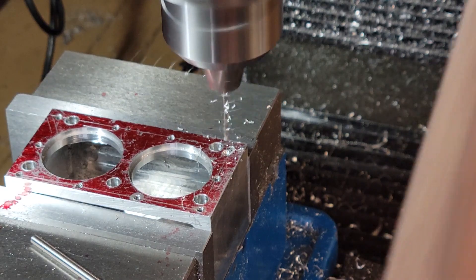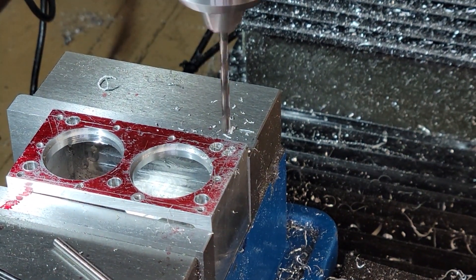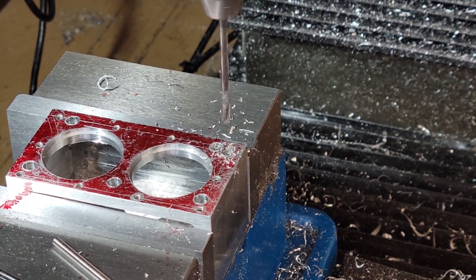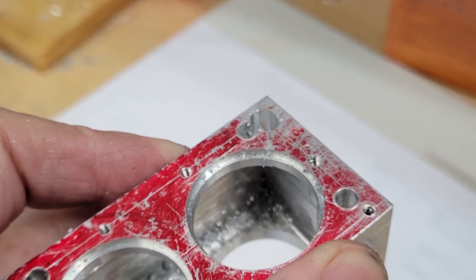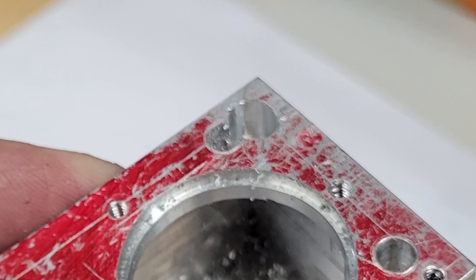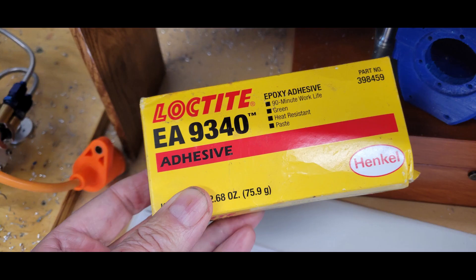I started with a small drill — actually a scrap drill — because if you hit that tap with a drill, it's going to destroy it. Taps are made out of very hard material. Then I used progressively larger drill bits, enlarging the hole until I was able to take a drywall screw, which are very hard, and use its sharp point to pry the tap clear. Then I loaded a quarter-inch flat end mill into the drill chuck and positioned it such that it covered the damaged area, then carefully milled down about 0.3 inches, which was the depth of the original hole.